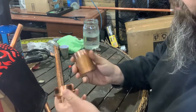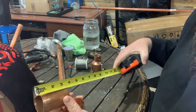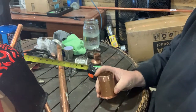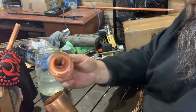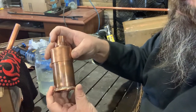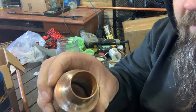Got a two-inch ferrule and a piece of two-inch pipe cut — roughly three inches. We're going to solder those two together. Once that's soldered together, we're going to solder this cap on here. This is a reducer, two inch to one inch. So far we have this — going from two inches down to one inch.